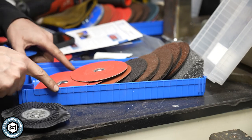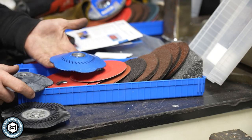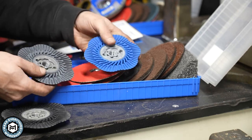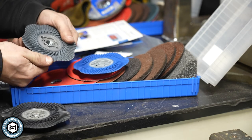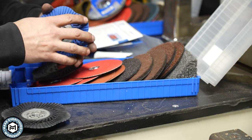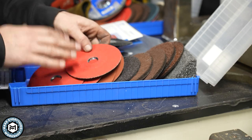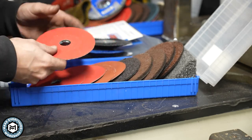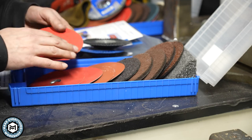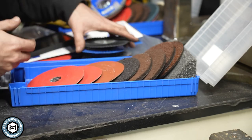I've got a four and a half inch set, and they also make these in a five inch as well if you have a larger grinder or have to accomplish a larger area. One thing that can add to this arsenal is you can use different stiffness in the backer pads themselves. I was using this softer black backing pad for the entire demonstration, but there's also a much stiffer one that barely has any give, which you could use if you need to grind something a bit harder. Obviously not every project is going to warrant using a system like this, but if you have to polish or do a uniform finish and want to quickly get between the grits — these are super fast, and they're not limited to just one type of aluminum oxide abrasive. You can get a lot of different abrasives that lock into these mandrels.